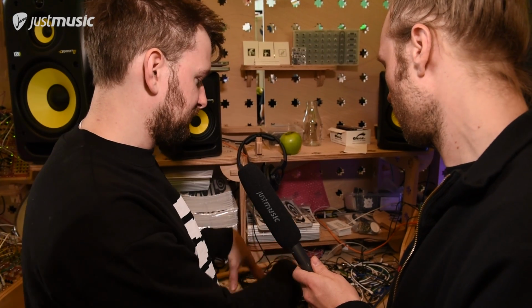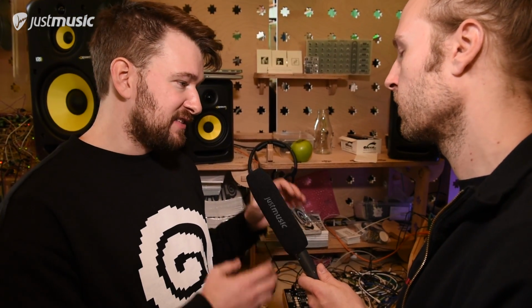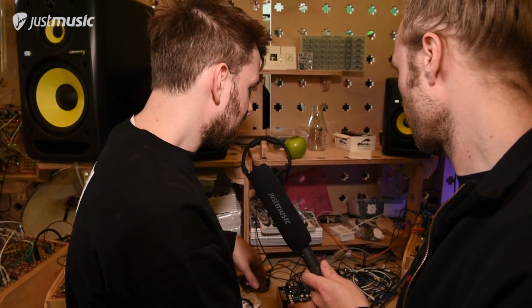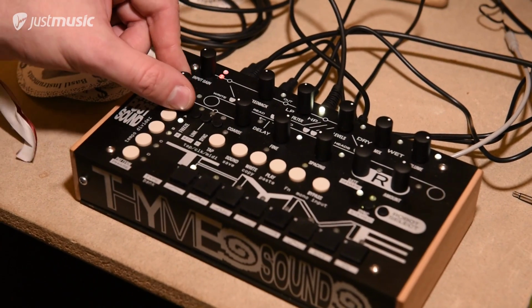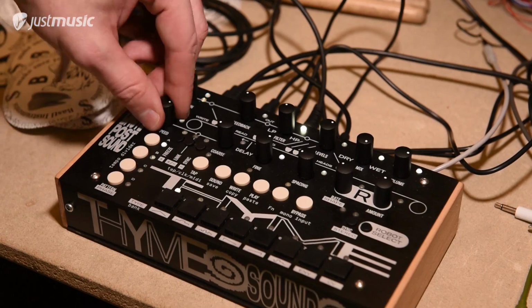Okay. So there are 9 different parameters that can control the whole sound processing core, and each of those parameters has a dedicated modulation source, and we call it a robot. The robot can be either LFO, envelope follower, or external CV. Okay, so it's 9 parameters, and each one has LFO or a robot. So 9 LFOs, and with that you can make really complex sounds that modulate also in stereo.